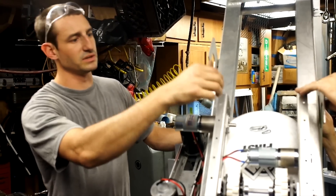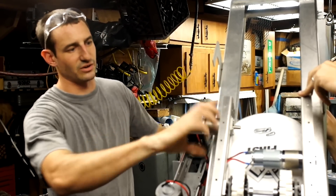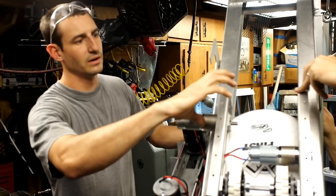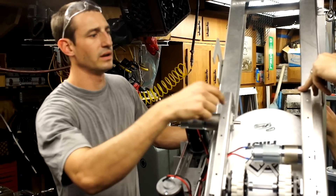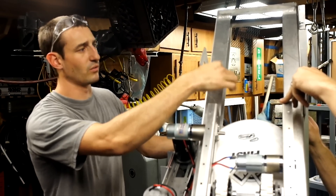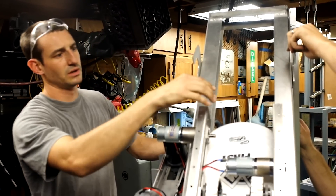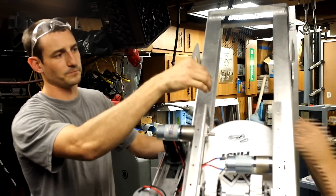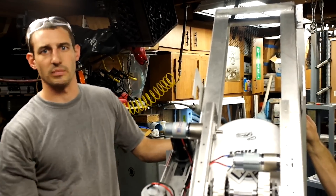What's going to pull these arms is a winch we're putting together in here. It's really convenient that our Modulox channel has enough space that we can put another PG-188 motor here, build a spool, and make a winch with cables running forward to a plate welded connecting the two hooks. When the cable wraps up on the spool, it'll pull the hooks forward and lift the robot just a couple inches off the ground.